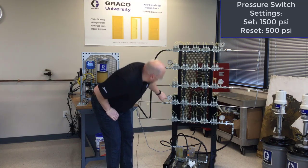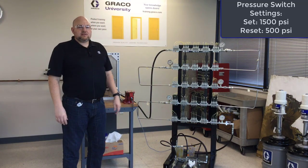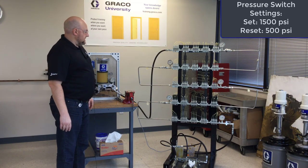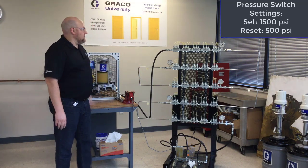This gauge doesn't show any pressure. This one's showing about 400 psi, this one about 500–600, this one about 700, and this one still shows about 800 psi. So you can see as we go through these stages that pressure drop is a huge factor, especially with a number two grease in three-eighths inch line. If this was quarter inch line, the grease would hardly be moving.